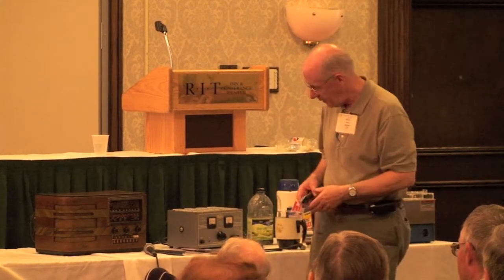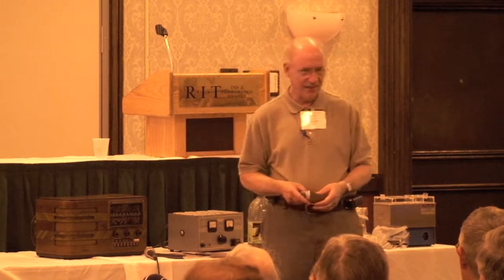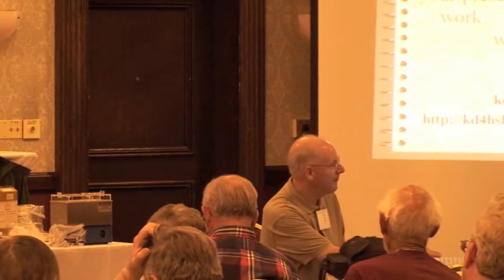I had one of these knobs, and I just used an industrial type soap and water softener. There are two kinds of Bakelite, one that looks like it's made of mud, and the real Bakelite. Real Bakelite cleans beautifully, but that mud one, I put one in there to clean it off, and I came back to a pile of mud in the bottom of the bowl and the brass insert. Yeah, you never put that mud pie Bakelite in.